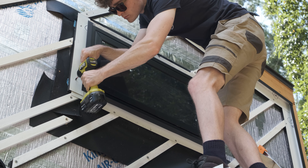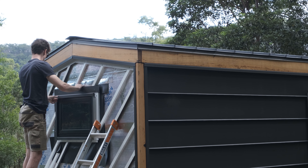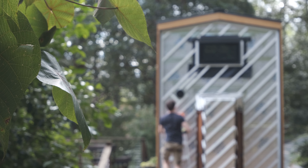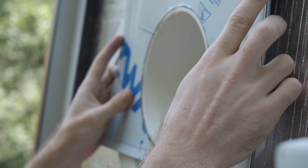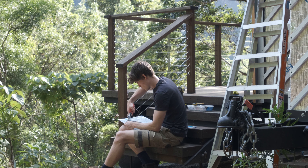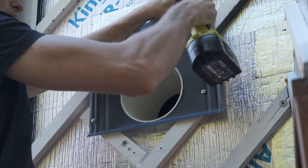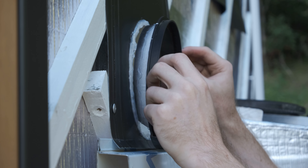As I install the window flashings, I'm using silicon to seal under the tabs I've folded over in the corners. The plate of metal I'm installing over the window will allow a place for the metal panel that eventually goes here to fold into and hold it to the wall. As the tiny house is airtight, I've installed vents at opposite ends of the house to allow fresh air to circulate inside when the windows are sealed shut. I hadn't originally planned for these vents when I made my order for cladding and flashings, but I had just enough extra. As they are circular I've needed to adapt a panel to cover the surrounds of the PVC pipe, and I'm just dialing in the fit now.